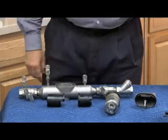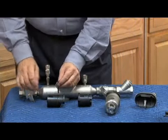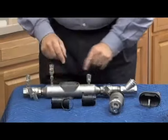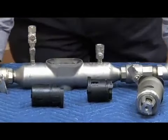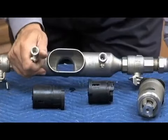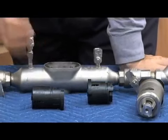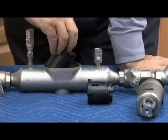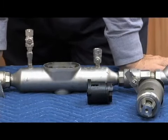See, it's a little bit longer body. The check assemblies are sealed by an O-ring in the middle. There's the O-ring that sits right there like this, so it slides into the body. Now, one of the problems with stainless steel tubing is, as the name implies, it's strictly tubing. You can see how the body was extruded, meaning it was stretched out to make this hole inside there. Since this is an O-ring seal on this check assembly, if we have any problems, like let's say thermal expansion,